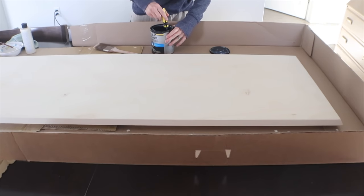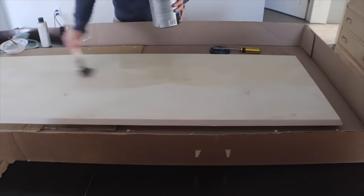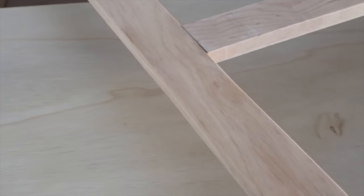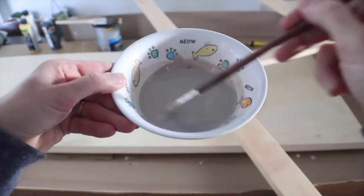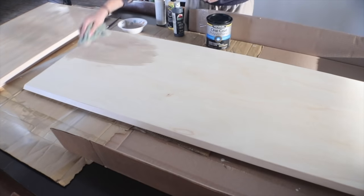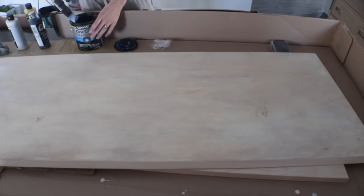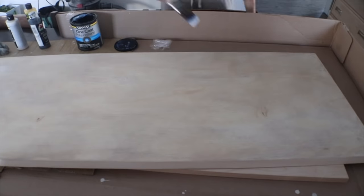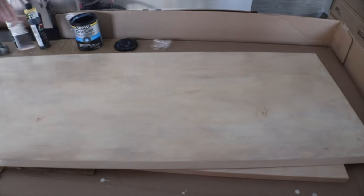I love the color how it looked on the face frame, but when I put the poly on the door the plywood was kind of yellow, especially in comparison to the select pine boards on the face frame. I really wanted them to match and look cohesive, so I ended up mixing a really custom wash — kind of like a whitewash where you mix a little bit of paint with quite a bit of water, but I mixed a bunch of colors of paint to get a pinkish brown that I thought would match the select pine face frame. After applying my custom colored wash the color was so much more similar to what I was looking for, so I let that dry and then applied a coat of poly. I ended up doing two coats of poly on the doors just to make sure they were very durable.